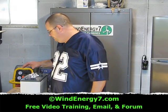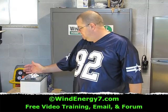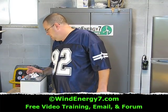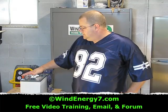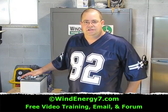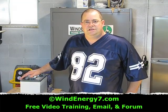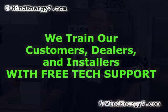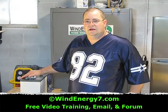The specifics of batteries are voltage. These are 6 volt deep cycle, and I believe these are 220 amp-hours. This is a 232 amp-hour battery. If you go to replace this with a 210 amp-hour battery, it's not a good thing. You need to maintain the same kind of amp-hour and the same spec in your batteries — they need to match. That's why I recommend using these because 6 years from now, if you have a battery go out, you're going to be able to get this battery. Who knows what's going to happen 6 years from now with a lot of other battery manufacturers.